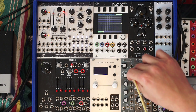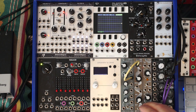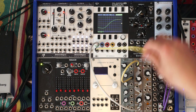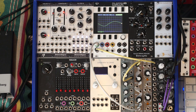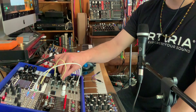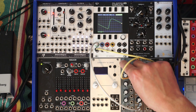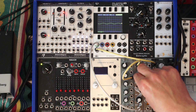First I'm going to plug in a saw wave from the ElectroSmith 3340 analog VCO into one of the inputs of the 2144 four-pole low-pass filter, and we'll take the filter output into the oscilloscope and then to my little ST-mix. So that's the saw wave we saw last time. Here's the filter with no resonance — I like that it closes completely so you can actually use it as a VCA too if you want. At the top position it lets the entire saw wave through.